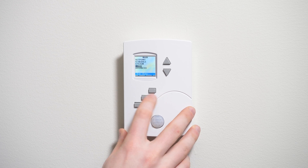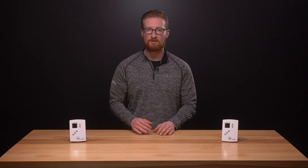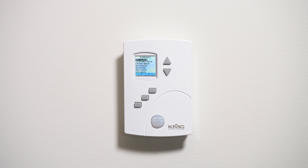Another benefit of the Appstat is that all models are native BACnet, ready to connect to a BACnet MSTP network. Device instance, MAC address, and baud rate are all set from the password-protected front controls. All models feature a real-time clock and BACnet schedule. The schedule can be set up on the front panel or accessed by BACnet objects and properties.